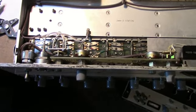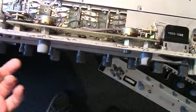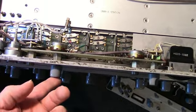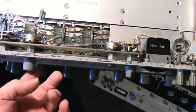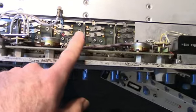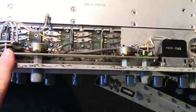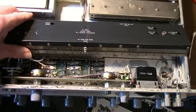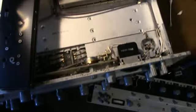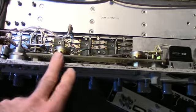So far on this unit, I found what may be part of my problem here. There are these mechanical switches — as you push the different buttons, you can see these switches are make-and-break contacts to the decade units. I found that some of these were corroded. They appear to be gold-plated, though I'm not entirely sure. I cleaned the contacts and we'll see how it works. I had to remove the input mixer to get access to that. It's quite easy to work on these — the cover plates are removed, allowing access to those.